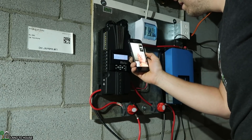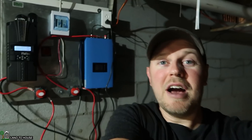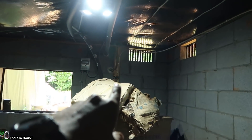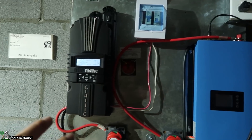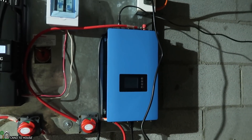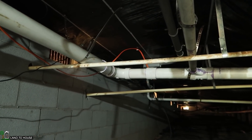It'll start loading it down and you'll see the wattage go up. You can go in there and adjust a few things on it, but I would just let it run like that for a little while. Let me show you what we've got going on. The turbine is in the creek running with one nozzle. The rectifier is right here, comes up, over, jumps down into the breaker box here, comes down, feeds the charge controller. The battery is being charged through that. And then we have an inverter with a grid tie limiter, which is plugged into this receptacle. And the limiter is over there hooked up to the main of the house.